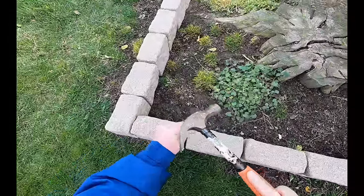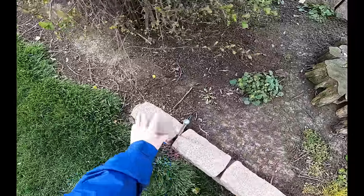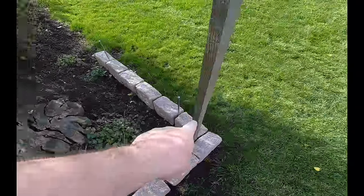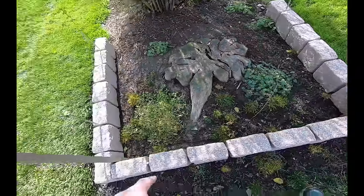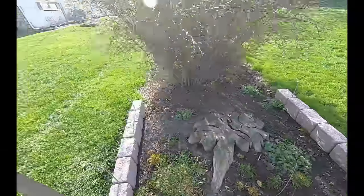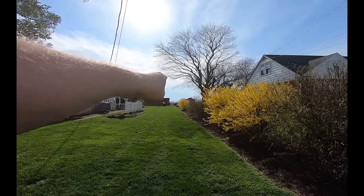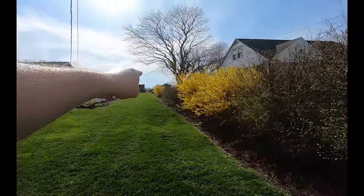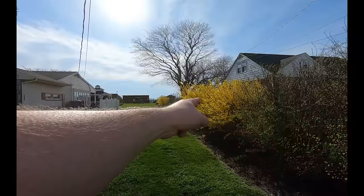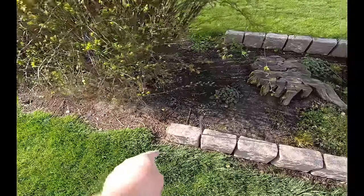We're just going to tap these in. I drove stakes on the inside of the wall — I measured from the inside to the inside over here: it's 49 and 3 quarters. I put those stakes right into the corners, and out in the back I lined up a stake with this front one so that I wasn't over into the grass too much. Then I measured over 49 and 3 quarters and put the stake on the other side. So now we're just going to run a string, doing this on the inside because I'll be working on the outside and can just overlook the string and see if I'm staying lined up.